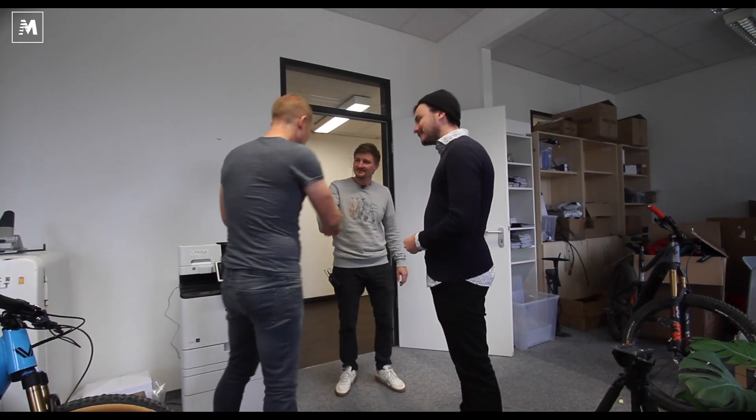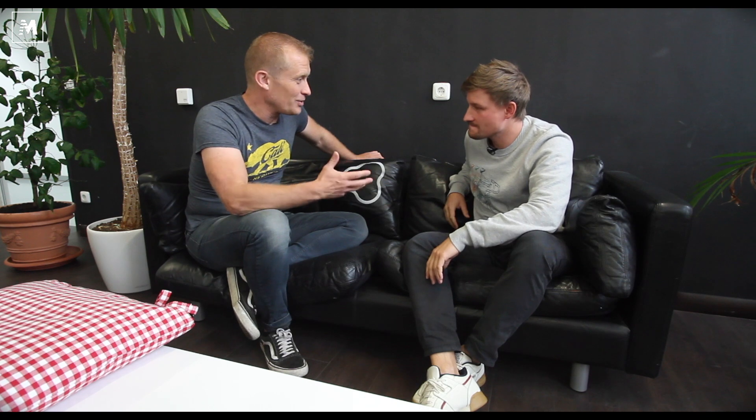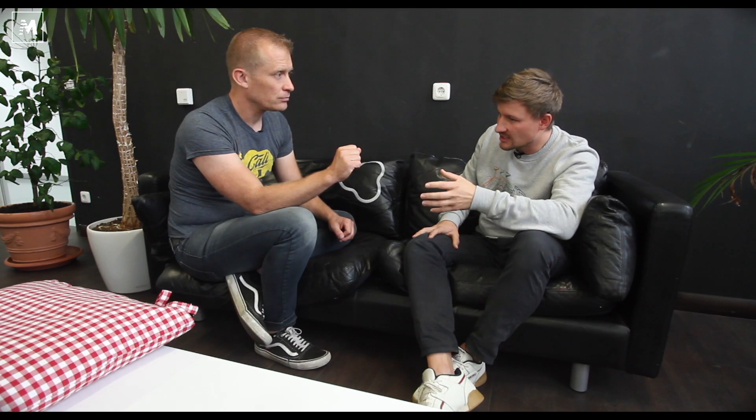And here is Philip coming — one of the co-founders when we founded the company in 2013. So when you look at the rest of the e-bike market, they are all around the bottom bracket, but you guys have made a motor in the down tube. The main concept idea was definitely to get a better integration of the drivetrain inside the e-bike, hiding as much as possible in the down tube. It's 4.7 kilos. The motor can deliver 400 watts, so in the end we get 315 watts roughly at the crank and 55 newton meters.